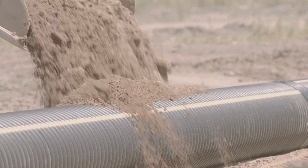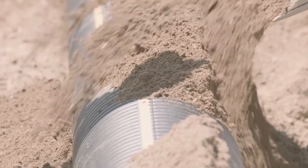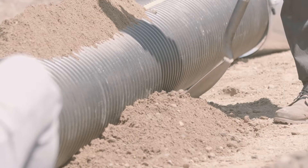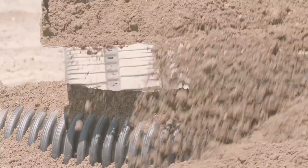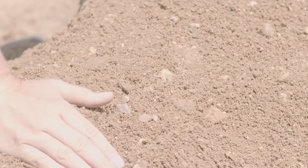With the pipe and aprons in place, it's time to start the initial backfill. Using the same material as the bedding, start backfilling the trench. Be sure to evenly fill the entire length of the pipe to not disturb grade or shift the product. Ensure the backfill is knifed into the haunch area under the edge of the pipe. Continue backfilling to the top of the pipe, stopping occasionally to compact the material. Make sure the material falls in between the corrugations of the pipe.